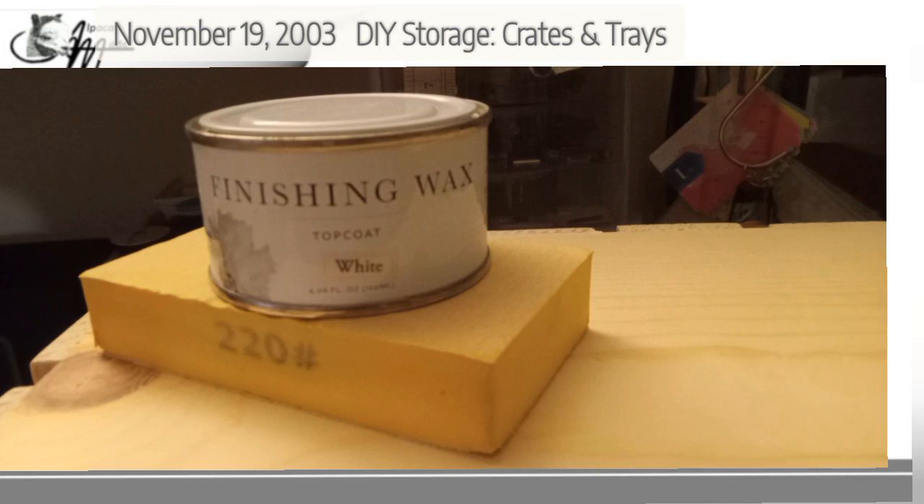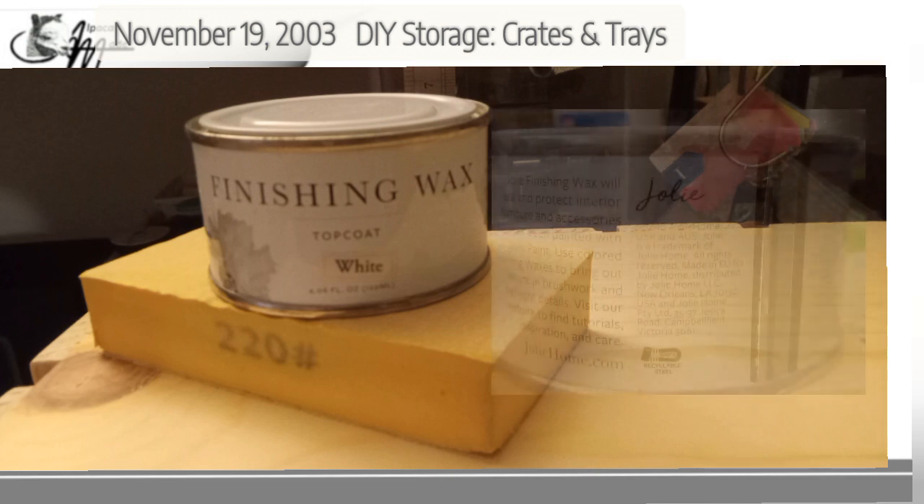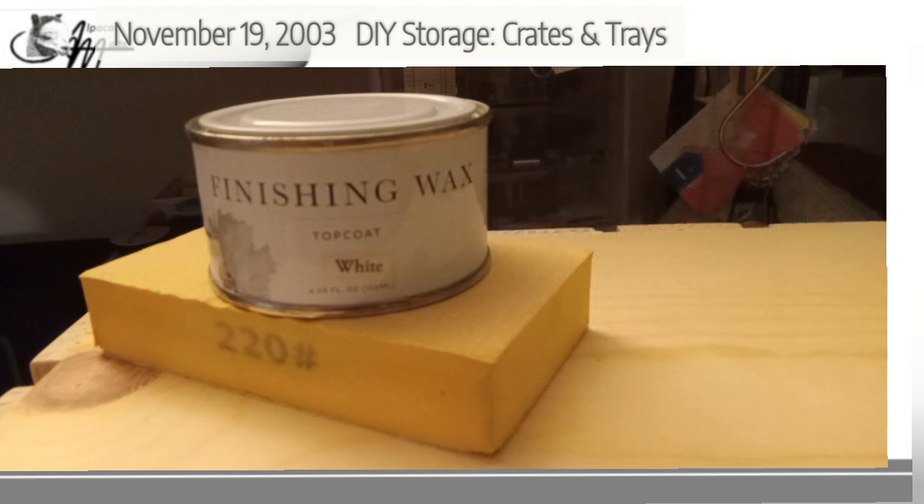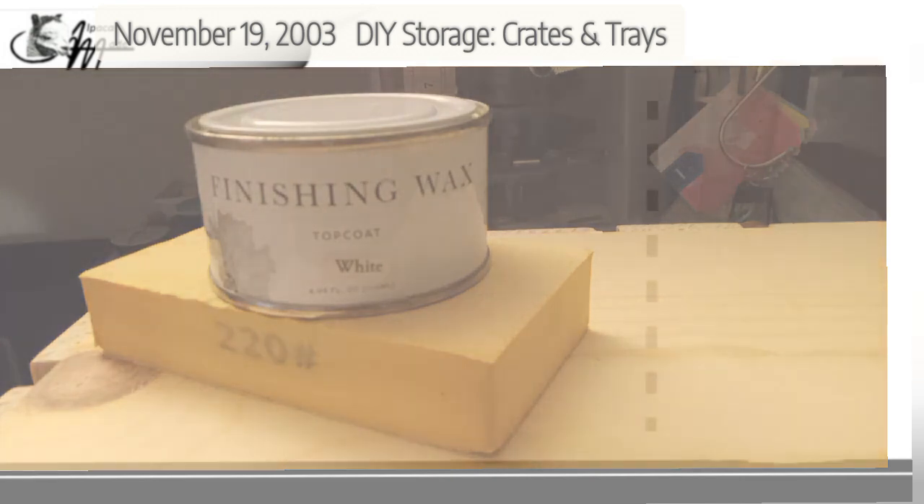So I chose white finishing wax, two coats — not thick coats, pretty thin coats. The brand I chose says it takes two weeks to cure. What I found is that if I put on thin coats, I could let one coat dry overnight and then put a second thin coat on the next day. It would still be a little tacky, but because the wood was already very dry, it's drying much faster than the two-week estimate.